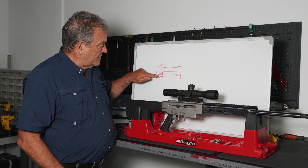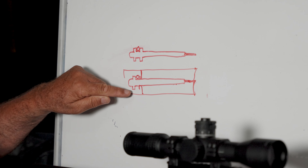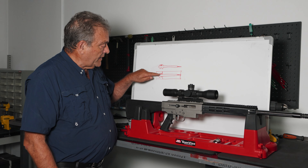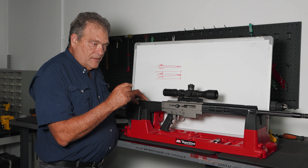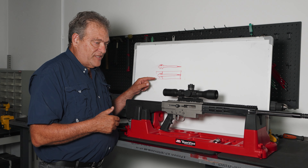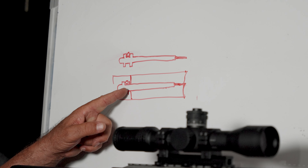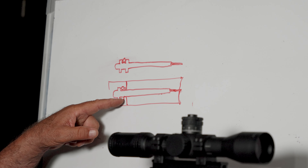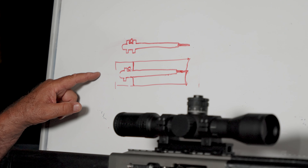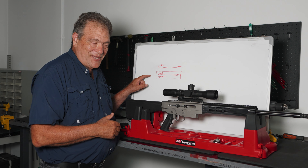If you look here, this is the firing pin that was in it — that's the bolt carrier. Between this back lug and this forward thin piece, a 3mm pin is what controls the total travel distance of the firing pin so it doesn't come out too far. What happened was that after a full day of testing, this stop here, which stops the firing pin going too far through the bolt, broke off just like that. That meant the firing pin could come all the way out of the bolt carrier, which stopped the day — it happened late in the day, too late to fix.